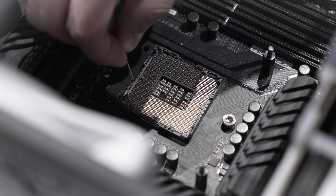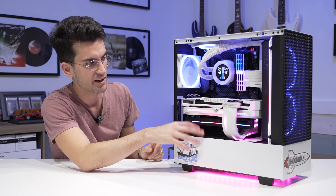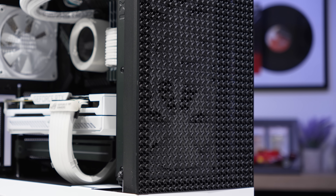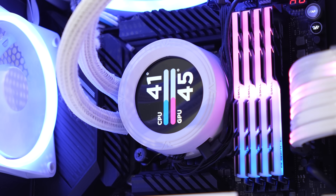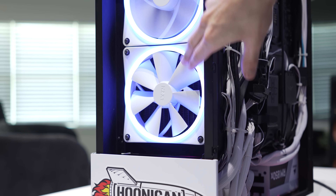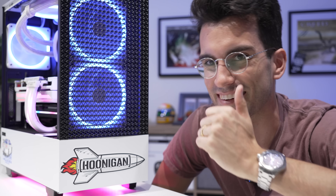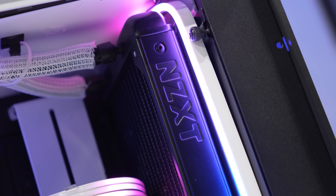I didn't notice that any of the pins were on the verge of breaking. We've had that happen in a few other instances, and I've told those owners that if they do have boot problems in the future, we'll address it probably with just board replacements. But this one I think will hold up as long as it's not being slammed around during transport. I've noticed that the CPU is running a tad hot — I just realized one of these fans is not spinning. This happened after I was tampering with it, so let's check connections. Found it — piece of cake. We'll get this reconnected. Now we're good to go. This should also help with CPU temperatures. I have powered this on over and over without issue — it loads into Windows every single time, the RGB all works, the fans work.